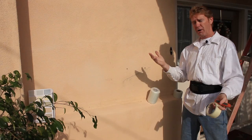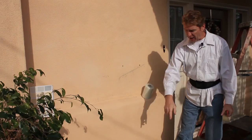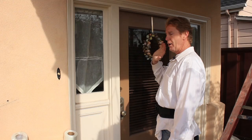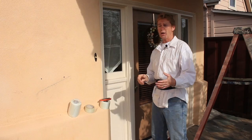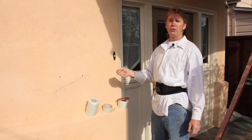We also don't have a drip screed here, which is not a big deal — drip screeds weren't mandatory until 1975 or 1980. The tile's locked in, everything is locked in. The main reason this wall cracked right here and not the rest of the house is because of this solid oak door. Every time you open and close it, it shakes the house. We did one at Sears Point Raceway 25 years ago — I stuccoed a three-story watchtower. They had a wheelchair access steel door that when released would slam the wall and shake it. We had a nasty crack you could stick two quarters into. Vibration causes cracking.